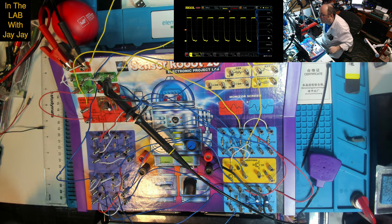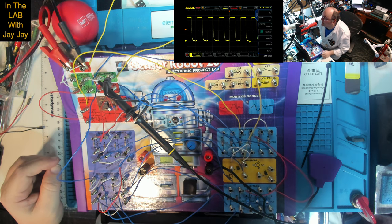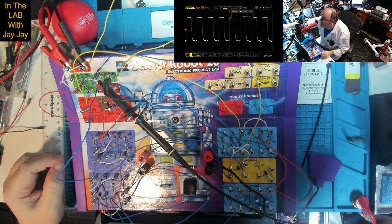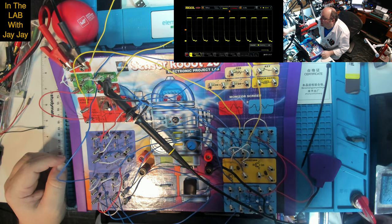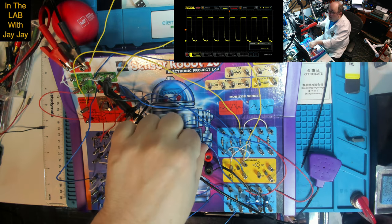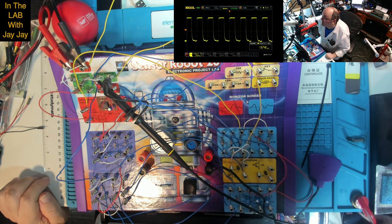All right. Now, it's set at 200 millivolts. How do we get the frequency? What about if we click utility? Measure. Counter. Frequency. Enter. Okay. And then we'll close the menu and we'll move him down there. And then turn that off again. And there we go. And run. And stop.